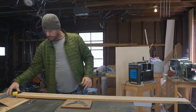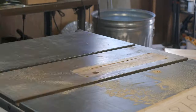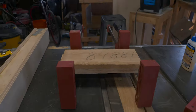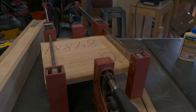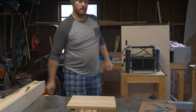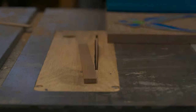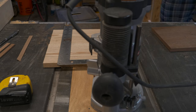Now I'm creating an oak backing because the mahogany warped a little bit and I wanted to make it straight again. I figured laminating two pieces together was the best approach rather than just resurfacing the mahogany itself. Now I'm planing it down to the thickness I want and cleaning it up. Then I'm squaring the mahogany and the Air Force logo — when I transferred it, it wasn't perfectly square with the edges, so I had to make sure all four corners were square with the logo. I want to recess the mahogany into the oak.